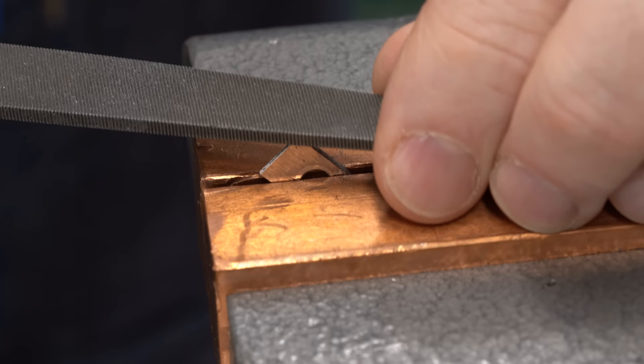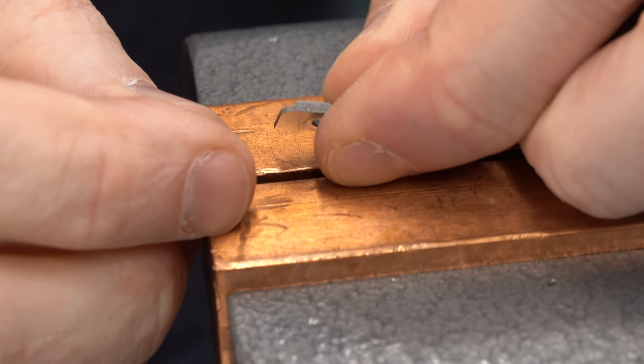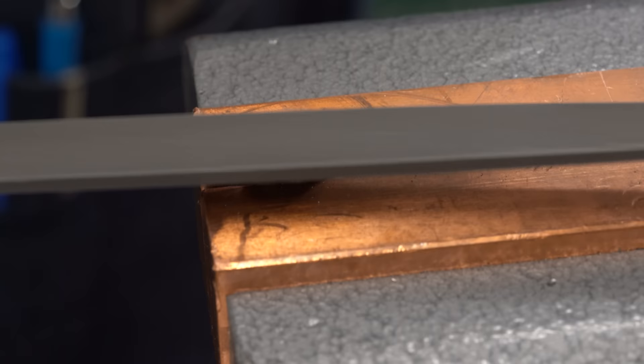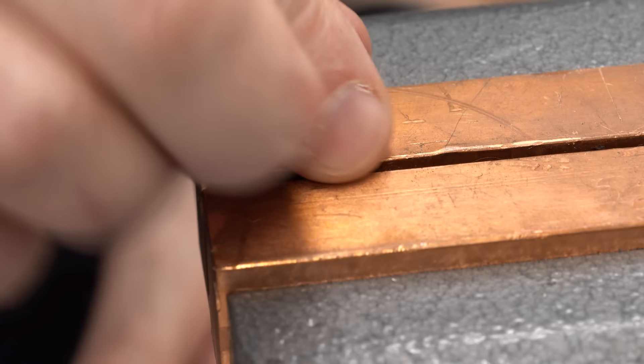I gave up on the needle files — this is actually a six-inch mill bastard file, a new old stock Nicholson file from eBay, and it is by far my favorite file. You can see I just got those points to intersect, so I'll flip it over and do the other side the same way. I'm using the base from my combination square to make sure these are at 45 degrees, then eyeballing the file level with the top of the vise jaws — close enough for a part this small.